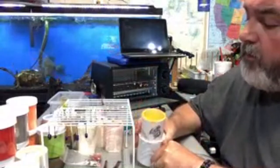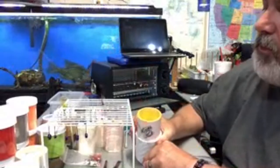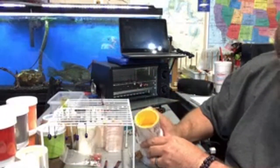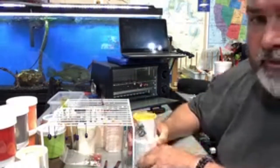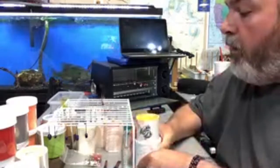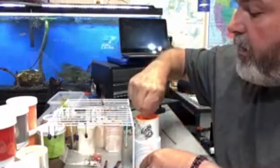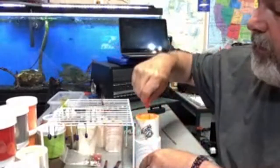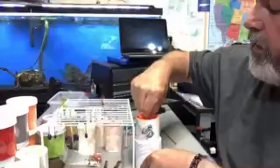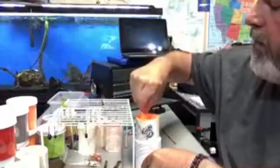And you can see I'm already starting to get a volcano out of it. What you're looking for, being a powder, you're almost looking for a water consistency down in the bottom. And to help with that volcano, we can stir it up a little bit and get that air to where it's moving a little bit freer. What it does is it gets packed down there at the bottom some. So that's what you're doing, you're going to unpack it and get it loose.